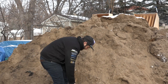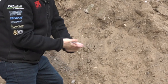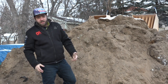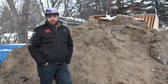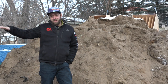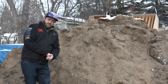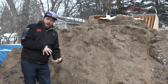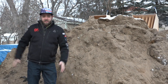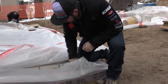As you can see, it's really nice playground-style sand — very consistent, not too fine, with fantastic drainage. It serves the site incredibly well. But as temperatures drop and snow comes in, if we didn't cover the foundation, this sand would get wet and freeze. Because water gets into sand so quickly, it would freeze right around and potentially under the footing, causing the soils to heave and wreak havoc on the entire structure. Let's peel back the layers and see what makes this foundation warm, dry, and unlikely to heave from frost.